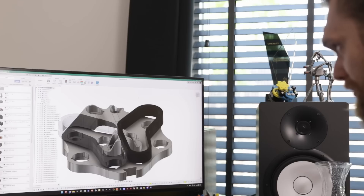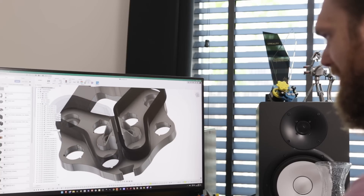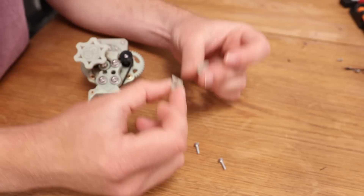I've got good news and bad news. The good news is that even with these flanges it runs as smooth as it previously did. The bad news is that the least flexible filament is still being pushed aside, and now it's the belt itself that's the issue. I didn't sleep well, but I think I came up with a solution. I've added these two belt pushers, so now it shouldn't be possible for the belt to be pushed aside. This belt can't go anywhere. There are two options: it just blocks because there is too much friction, or it works. Hopefully these two small pieces are the solution.